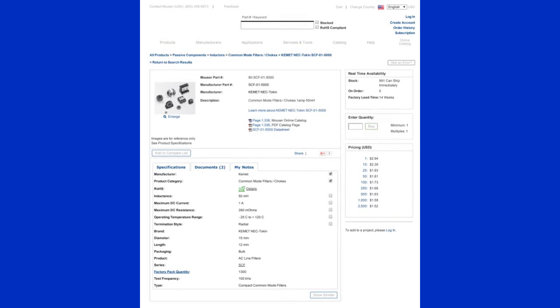I found this one off of Mouser for $3 and it was rated at 50 millihenries. You can use one that is less than 50 millihenries and is cheaper. I even tried using a 7 millihenry choke, it really didn't make a huge difference.